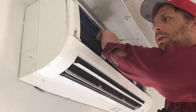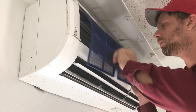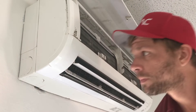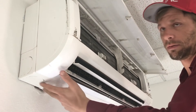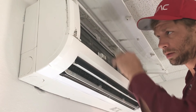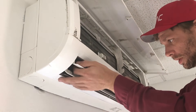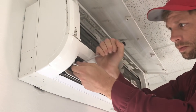The first thing I'm going to do is take apart the air handler so I can access where I need to be cleaning — the coil and the blower wheel. With the SpeedClean bib for the ductless, it goes underneath the whole compartment and you don't actually have to disassemble in every situation. Depending on how dirty your equipment is, you can leave it in place and wash through. But this one's pretty messy, so I need to open the whole thing up to get a good cleaning.